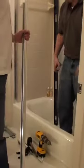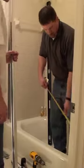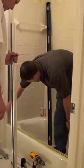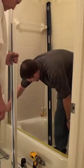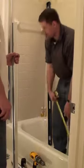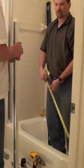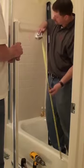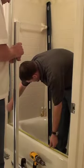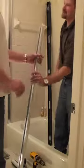Alright, so we got both jams up. The curb on the Cardinal door is an interior set curb, which is nice because it kind of helps you leave your options open. We'll go ahead and get a tight dimension here — about 57 and 7/16ths. A lot of times people will tell you to bust your tape to get an accurate dimension, but it's also the most surefire way to miscut a piece of metal by 3 inches. 57 and 7/16ths — and this came out of the box perfect.